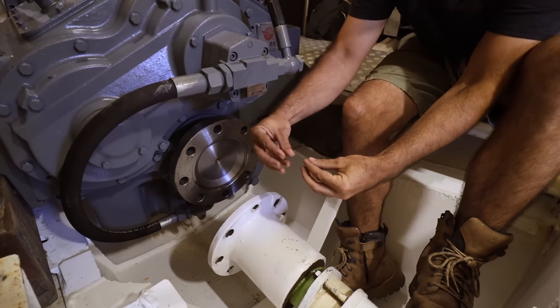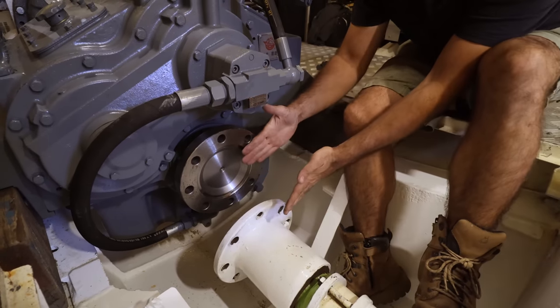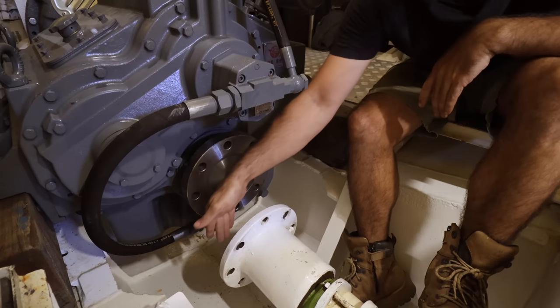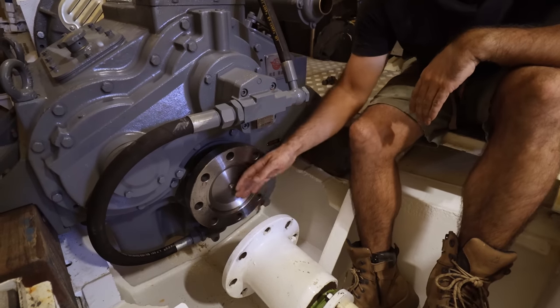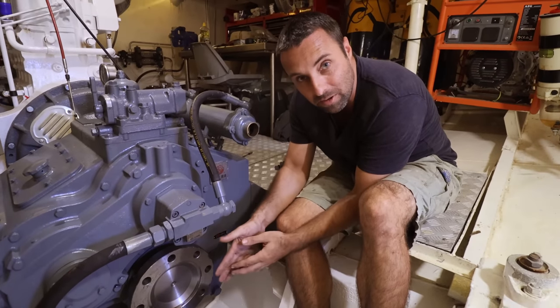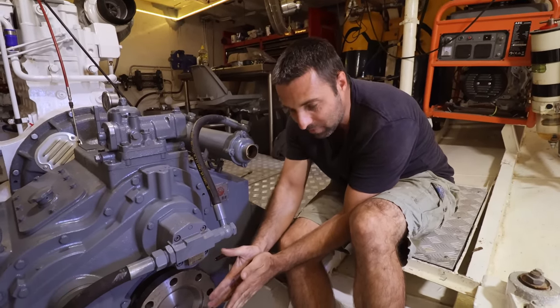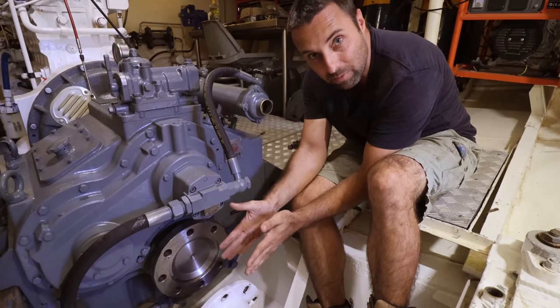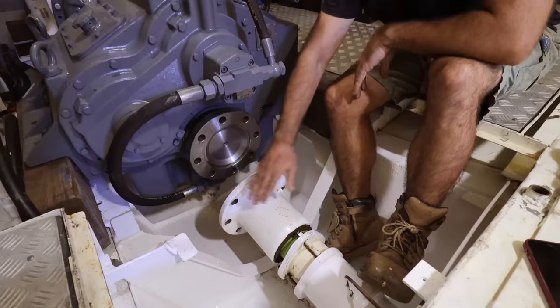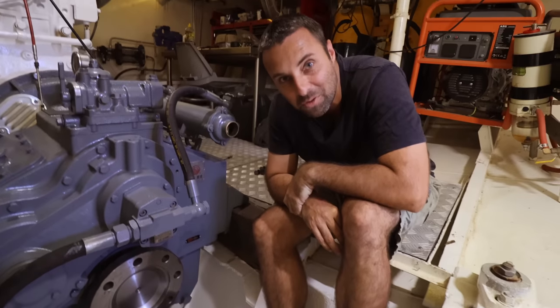So if this gearbox is slightly off, the dial gauge will help me bring it in so that it's absolutely perfect. Then I bring the two of them together using feeler gauges, and I can go through and get the shafts within about one thou. The chockfast system makes it much simpler to do the alignment compared to shims. The previous engine I had down to 1.5 thou out of alignment, which is completely within the 9 thou spec. Yeah, it's a pretty straightforward way of doing it. It's how they've done shaft alignments for the last 200 years.